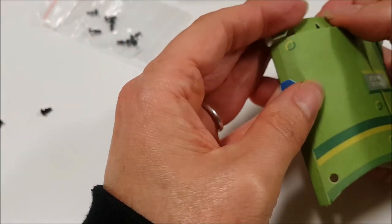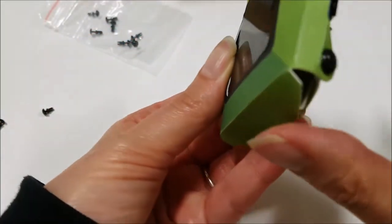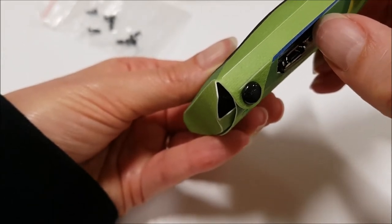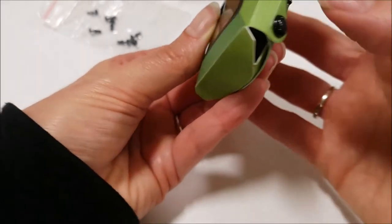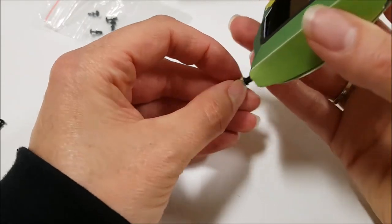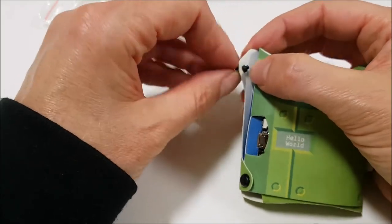Put this flap back so it can stand up. We're going to go ahead and turn it on. The power switch is right next to the USB port. Press that down and don't release until you see green — you'll have an LED come on if your battery is charged. It looks like this battery may not be charged. Normally about 90% of the time the battery is charged when it arrives, but out of 200 cases I've had about 10% where the battery is not charged, so you just need to charge it.